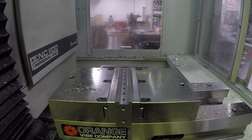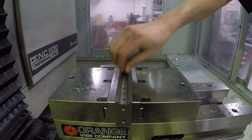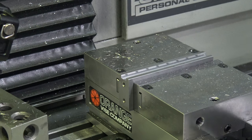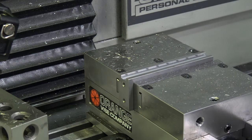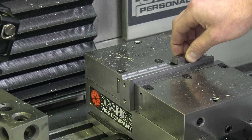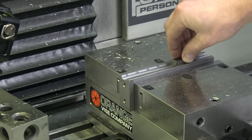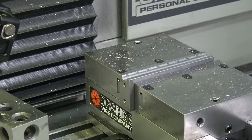Okay, well, screw the gauge box. Look at that. Oh, folks, no friction and no play. Here's a half inch. Obviously, that's going to fit. So let's see, does a 501 fit? Barely. Okay, so it does fit, but you can't really move it. So I could have maybe taken just a tenth or two less, but I'm happy with that.